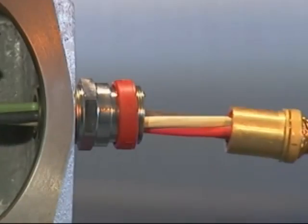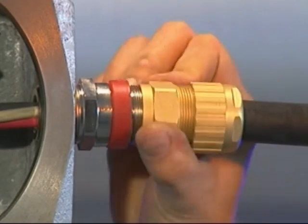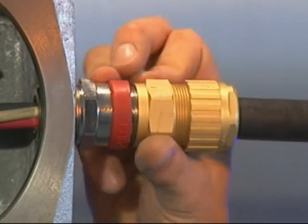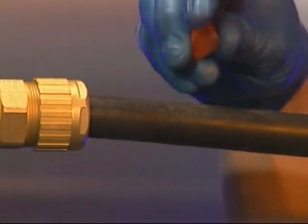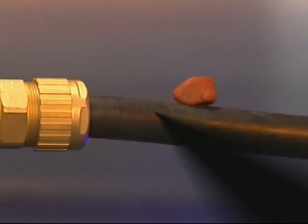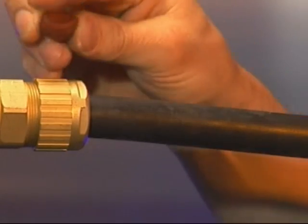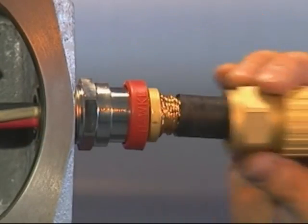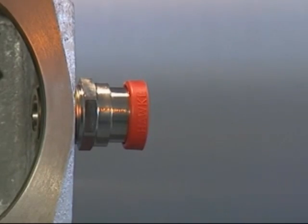Push the cable into the entry and locate the compound pot inside the entry. Then bring up the middle nut and hand tighten onto the entry. A handy tip is to apply the surplus compound onto the outer sheath of the cable in close proximity to the cable gland. This can be tested periodically to ensure the compound is hard before finalising the termination into the equipment. Once the compound has cured, untighten the middle nut and check that the compound has cured properly.